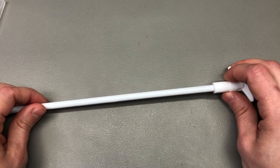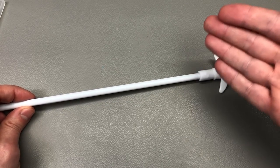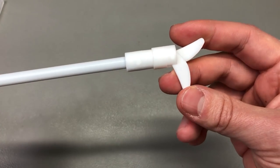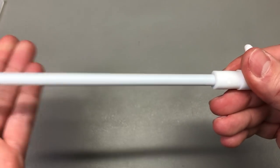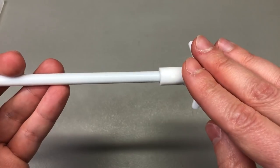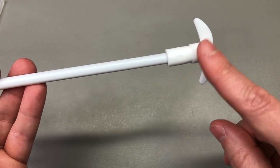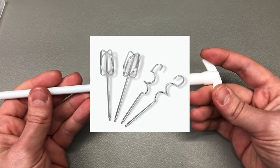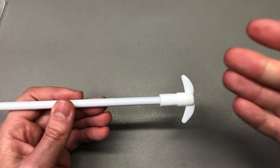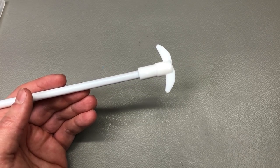Next up, I got some dry solder paste that I want to reactivate and use, so I was looking for ways to high-speed mix the paste to remove the hard lumps that have formed. I found this lab chemistry stirrer on AliExpress — it feels like it's coated with some kind of chemical-resistant plastic, maybe PTFE, and it has fins on its end. But after receiving it, I realized it's not going to get the job done. I ended up using a metal mixing tool from a kitchen mixer attached to a bench stand drill, which kind of did the trick. The paste is still not at perfect consistency but I think it's usable, and I'm going to test it soon. A new jar of lead-free paste is kind of expensive, so I'm going to try to salvage the old one if I can.